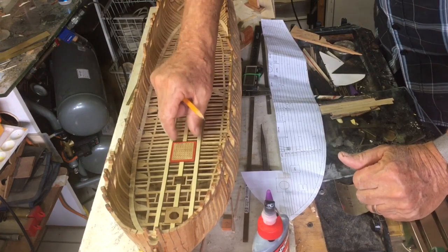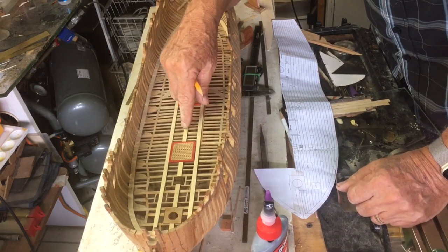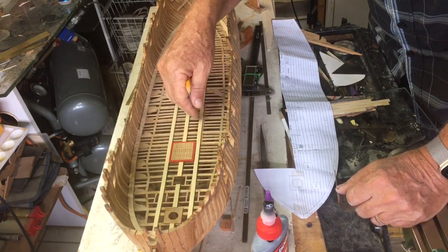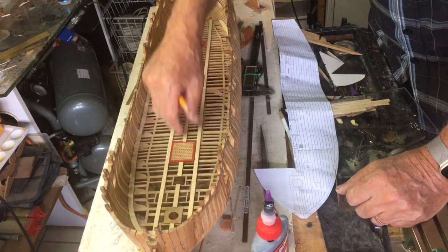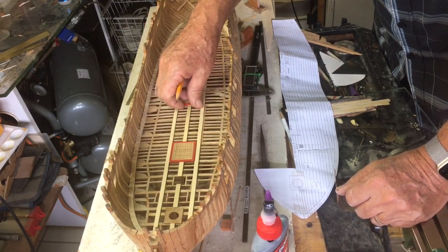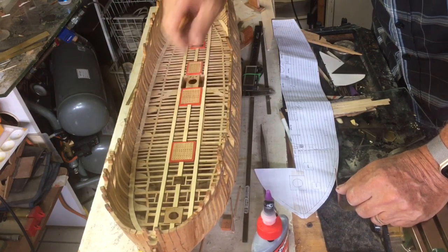We're going to first fill in this centerpiece around the king plank. We have 30 inches between the king plank and the binding plank. So that means we'll have three 10-inch pieces on either side. And it's roughly the same all the way through. So we'll cut some 10-inch plank stock. And I'm quite sure we'll have an adjustment as we get close to the king plank.